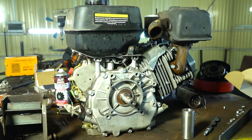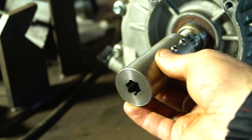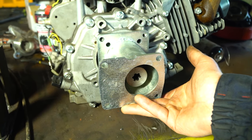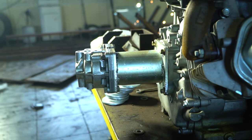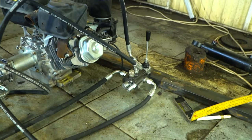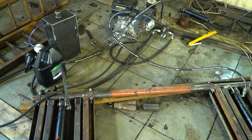The 4-ton cylinders are quite weak for such a jack, but they were at least available. Next we'll need a hydraulic power unit to fill the cylinders with oil. There's an almost ready-made version in stock — a gasoline engine with an adapter to a gear pump. Using such a hydraulic power unit you can lift a car practically anywhere, which is useful for a garage with limited power. The adapter consists of a coupling and a gear pump fastening. We installed a GP16 pump as it was already available. We'll also need a tank with hydraulic oil, high-pressure hoses, a single-section valve left over from a track-type tractor project, a T-joint, and two hoses for the hydraulic cylinders.